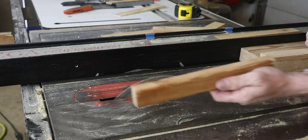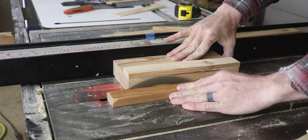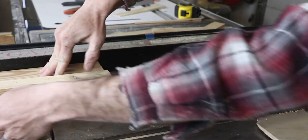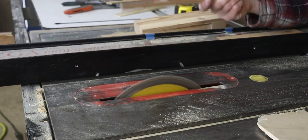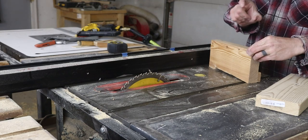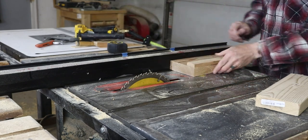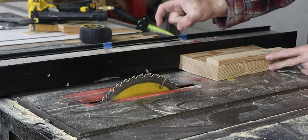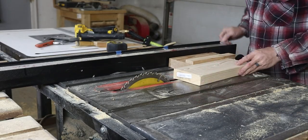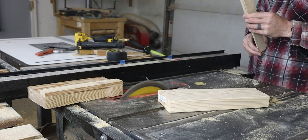This is where it starts to get interesting — you can finish off cutting all your shims with this piece, or what I like to do is make smaller shims like this. Now instead of having a two-by-six scrap you've got this little piece. One of the things contractors like is shims that are a little bit thicker, and this is where things become very customizable. I'm going to double the thickness of my shim by adding the thick part on the face — make sure it's backwards to the shim you want to cut — and that'll make you a shim that is doubly thick.